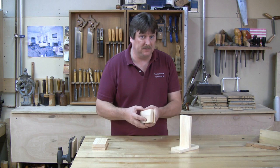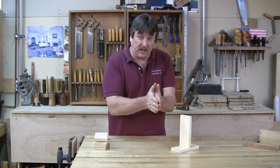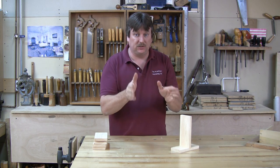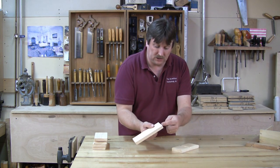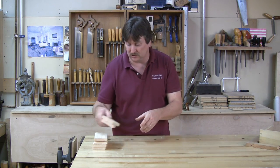But we still haven't seriously taken advantage of that side grain to side grain bond, and that's what we're shooting for, because we know that if we can get those things to bond together, that joint isn't going to come apart easily, because you're going to have to break it the entire length of the straw, as opposed to just those tiny little holes on the end of this board against the sides of those straws.